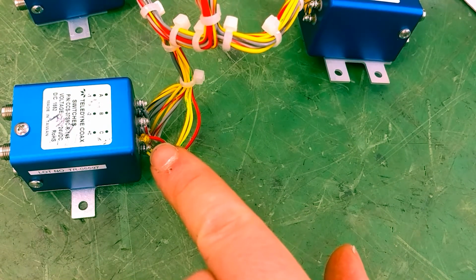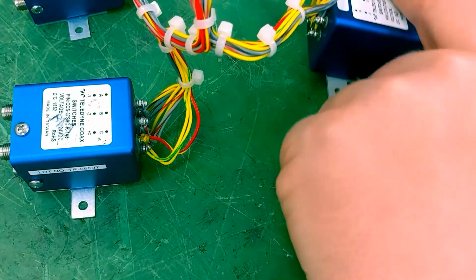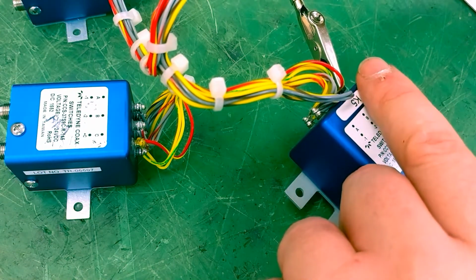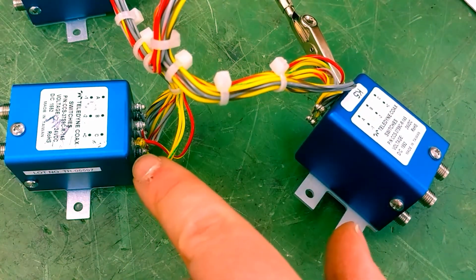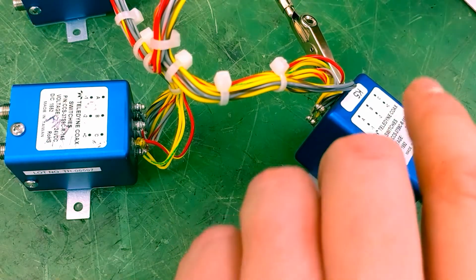Okay. Now, in order to take this off, what I've also done, now it's not as important for where your 24 volts comes in, because remember in our diagram that isn't jumpered over onto the other relays. That line is independent, but the other ones are. Okay, now remember I said that there's probably glue in here keeping this thing. That could be another reason why you can't apply that heat for very long.